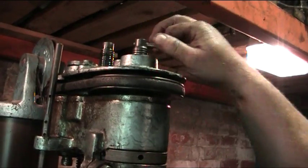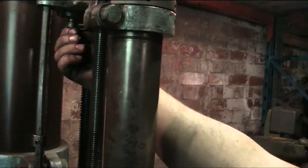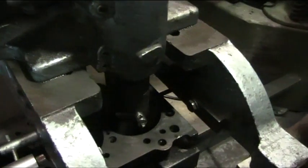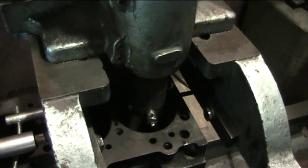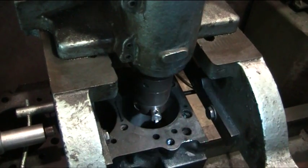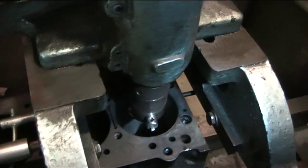Then we engage the clutch and the back gear for driving the machine. And then we're just about to take a cut now. We'll try and follow this down the bore — a little bit dark, but we can see it here and we've got a little torch to help the camera out. So here we go.